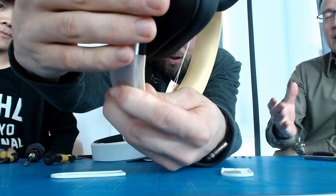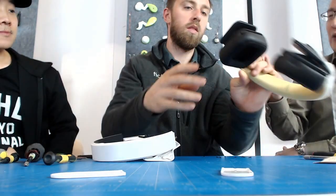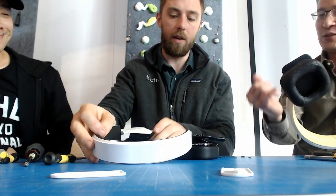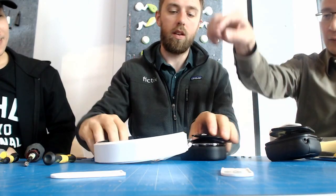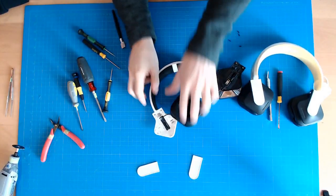It basically pushes the whole headband out on the spring and pulls it back in. But it does it in a not very elegant way, and it doesn't look pretty when you turn it. You can still see the detent. So we actually rethought how it all worked, and we managed to squeeze everything onto the shaft itself and do all the camming and detenting.